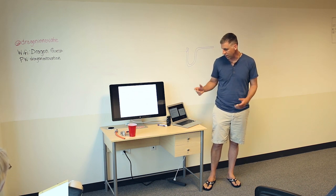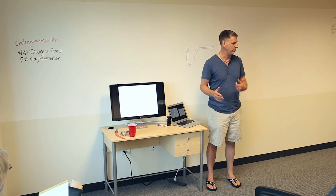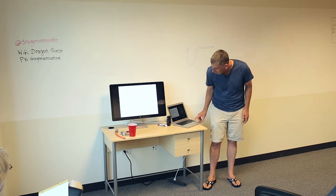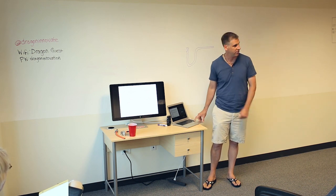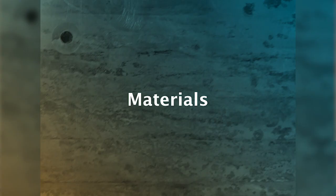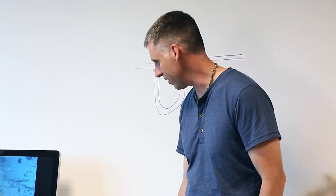And then the tolerances are relatively similar to what you'd see for injection molding. And again, it does depend on the alloy. And this is just talking about secondary ops. They are hateful, but they are going to be in there. But otherwise, I'd use exactly the same rules as you use designing a part for injection molding.